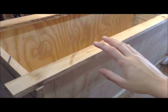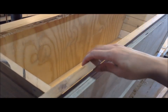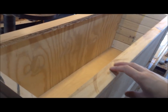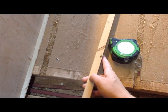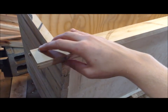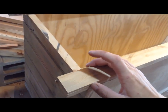I ripped that piece down to an inch and a half, then cut three three-quarter-inch slabs off of that. One will become my bottom rail, one will become my top rail, and then with the third one I cut it into three-quarters for my sides. I'm going to cut these down to my perfect width so they fit on there, and then I'm going to be joining these with lap joints on all four corners.